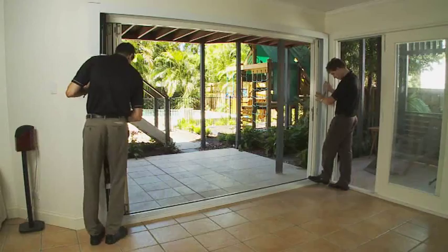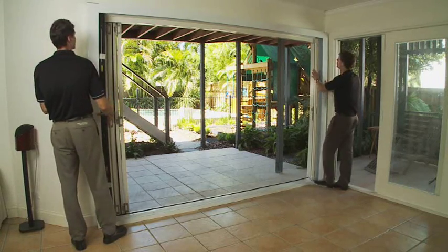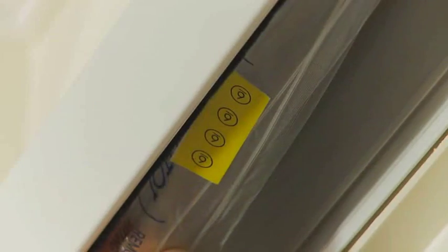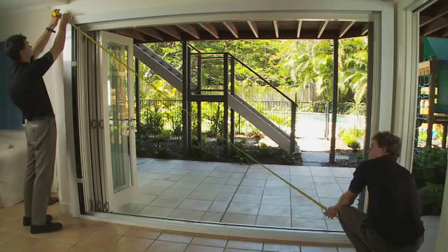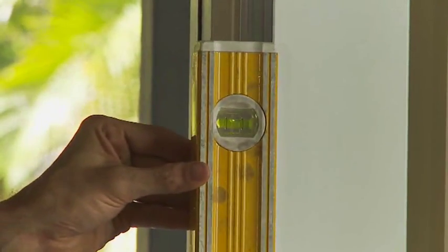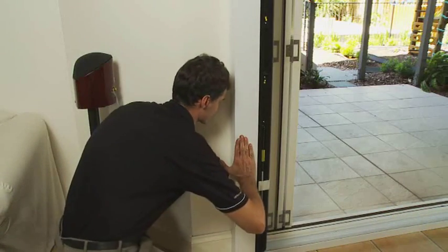Fix the head section into a solid supporting structure through mechanical or adhesive fixings. The head can be screwed off by using the holes provided with a right-angle screwdriver bit, available from Centor. If doing so, ensure the head is level and the screws do not interfere with cables or stile operation. Square up the frame in the opening. Once the screen is square, pull on the double-sided tape backing tabs and press jambs against the door frame.